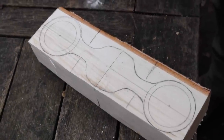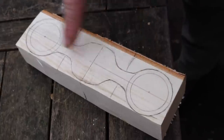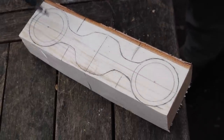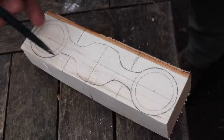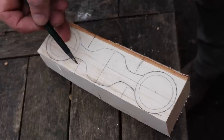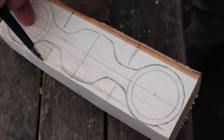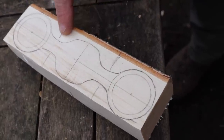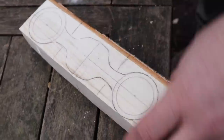I've now marked out both scoops — tail to tail. I've added these lines: I'm going to take a saw and put a stop cut in here, so that when I use an axe to chop this way, any splits generated won't take the tail out, or vice versa the bowl. We'll have an air gap caused by the saw here — that's fairly common to do, to protect a concave curve.